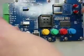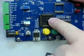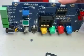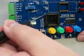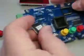You line up the chamfered side with the dot — that's pin 1. On the socket there's an arrow right there that says pin 1. On the silk screen there's a little notch in the line — that's pin 1 too. And on the back there's a square pad — that's also pin 1. So there are four indicators for pin 1, including this chamfered corner right here. That's the side pin 1 goes on.